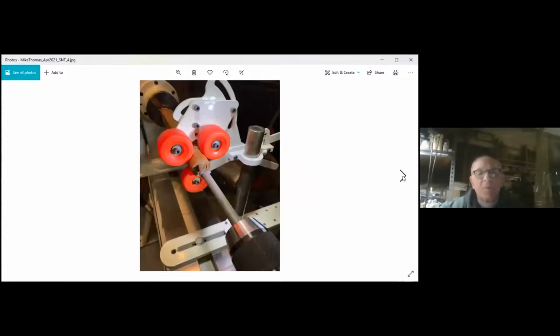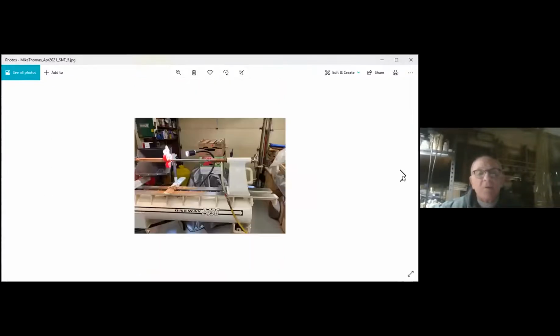Oh, that's where I'm drilling the pilot hole. The next one. That's where I've got the gun drill in the pilot hole, and I've got it hooked up to my air compressor. And all you do is press on the tailstock, and it just drives. The piece of flute wood is rotating by the lathe, and you just press on your tailstock, and it goes all the way through in one pass, and it polishes it and everything.